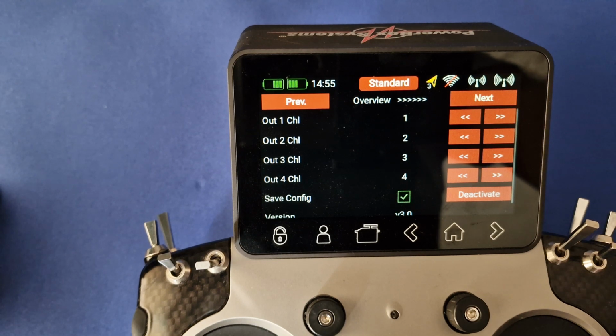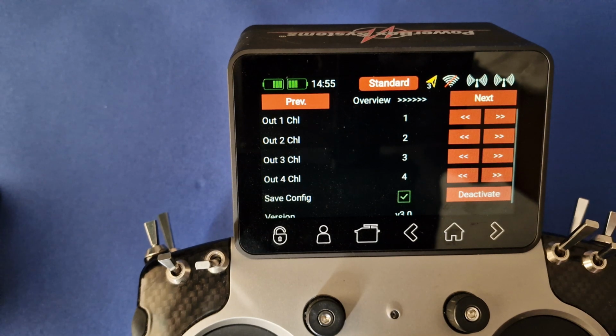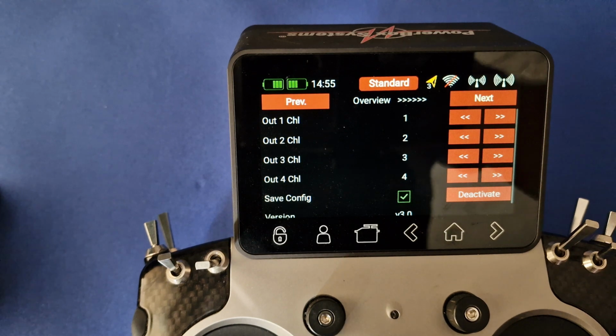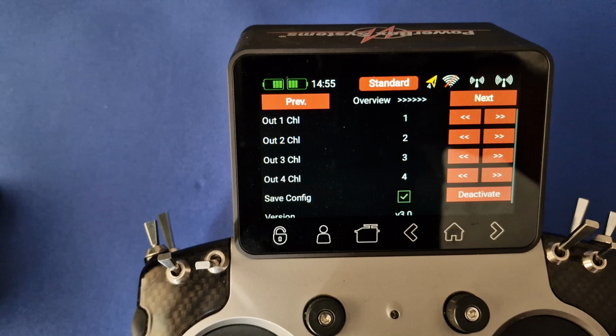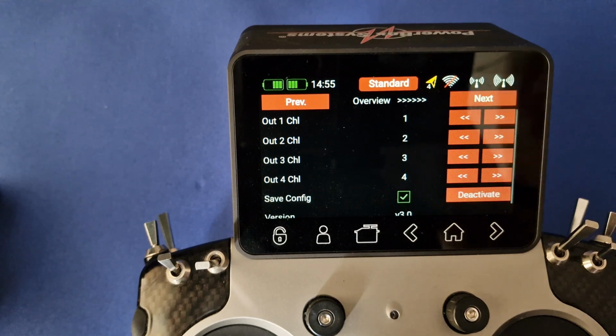It now still has all that functionality in there. It's a bigger system, a slightly different design, but that's all in there, so you can still use it as an XB1CV4. And if you plug it into an XBus connection on your JR radio, then you can directly access that, and you just treat it as if it was that. Download the instructions for the XB1CV4 and it follows that, and it will work in exactly the same way. So again, you can assign multiple different XBus channels or sub IDs, if you're familiar with XBus, to the outputs. You can then adjust the outputs using the transmitter screen that you get with the JR DFA transmitters, and that gives you that full capability to do that.